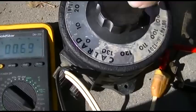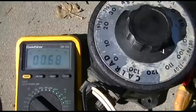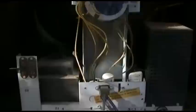Oh, yeah. At 110 volts, we're only at 0.7 amps. So I'm driving 2.3 amps through the rectifier tube. That's not healthy. This thing would make all kinds of pretty colors at night. So yeah, something's shorted. Either one of the filters is shorted or something.